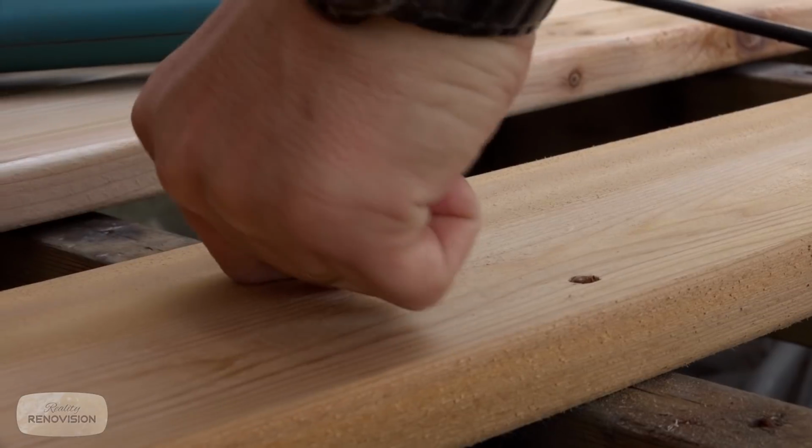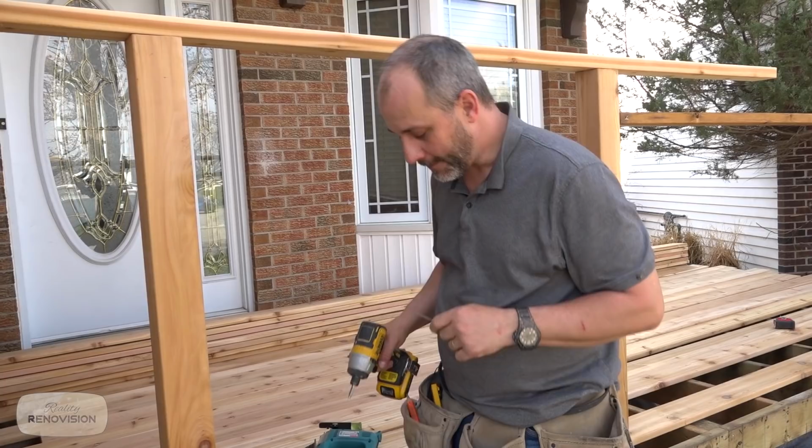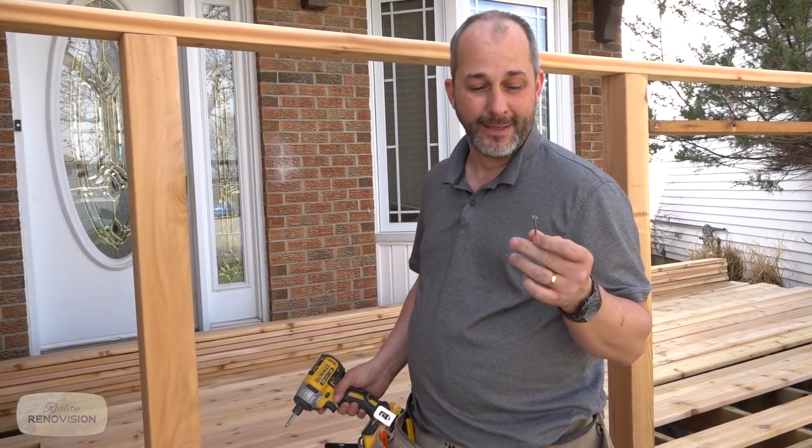And what happens is that wood will end up swelling up over time and slowly close that hole over. It'll be perfect. Here's a note for you. There's 2 colors of screws in the market where we are, green and brown. Generally speaking, pressure treated lumber came in green up until recently. Now they have a brown pressure treated lumber. They still have a green pressure treated lumber.